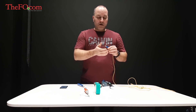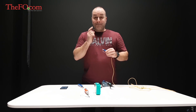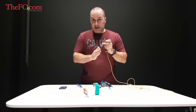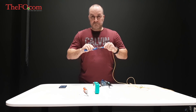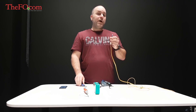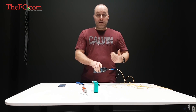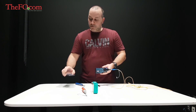If you've got embedded crusty dirt on your connector and even 20 clicks of this will not work, you can use the wet wipes. But what is really important is when you use the wet wipes, you need to dry it off afterwards. So if I wiped the end of the connector with a wet wipe, I would then use a click to just dry it off — to make sure there are no oily residues on the connector's end face. A wet wipe that isn't dried off basically gives the same kind of results as wiping your finger on the connector. You've got a lot of oily residue and it's going to fail.